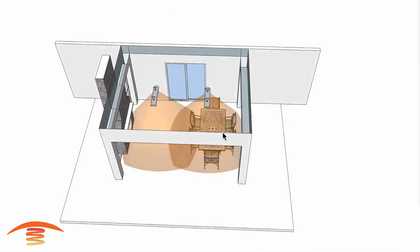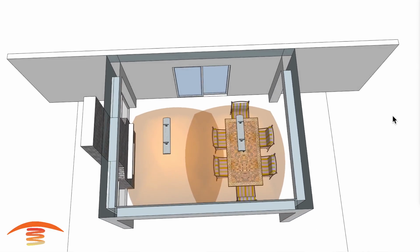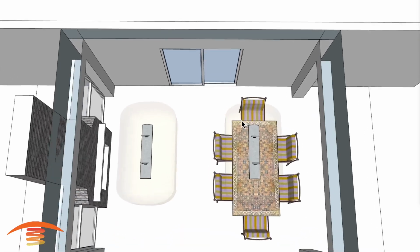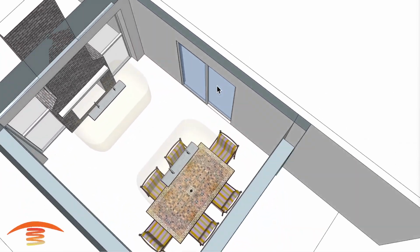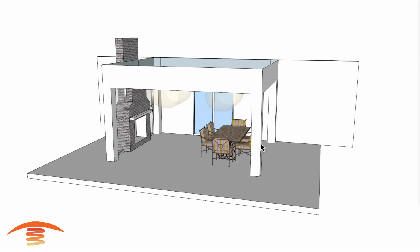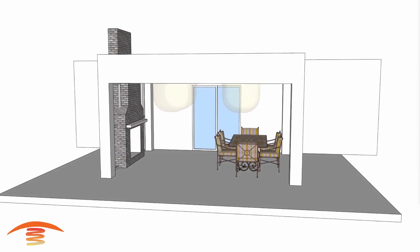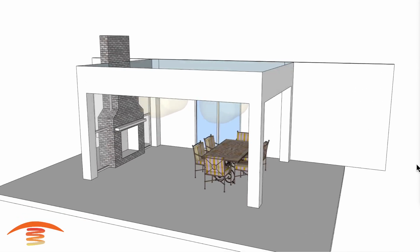But in any case, this option would be okay, especially if you have those issues with regards to clearances above the heater itself. We'll go ahead and look at the clearance areas again, 18 inches on all 4 sides. And if this door came out further, this unit might be a better option. But I would say this is a 90% coverage, okay. And the first option I showed would be the 100%, not 100% coverage, but the best option.